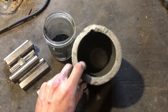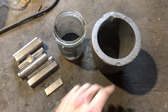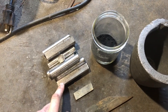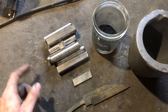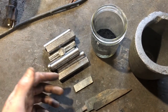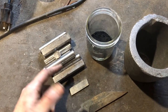Here's what we've got to start with: a clay graphite crucible that I've gone ahead and baked in the oven at 300°F for an hour and a half to drive off any excess moisture, so it doesn't crack during firing. Over here I've got 1,500 grams of mild steel as our base material. Last time I used wrought iron, which turned out fine, but you never really know what's in wrought iron — it can have impurities like manganese, sulfur, or phosphorus. If I want this to be repeatable, I need to know what I'm using, so I'm using mild steel.